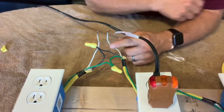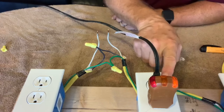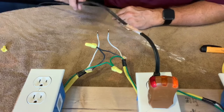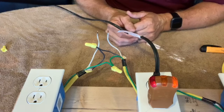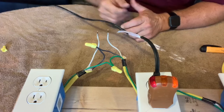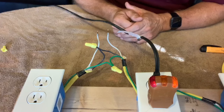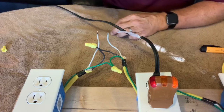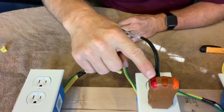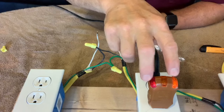It comes on because there's now a voltage difference between the ground wire and the neutral wire. That's because this neutral wire is now live — it's got 120 volts. That's because you've got power flowing through the hot leg of this cord to the lamp, through the bulb, back through the cord. When you don't have current flowing, there cannot be a voltage drop, so there's no voltage drop at the light bulb. Instead, it's basically just a conductor — it's conducting that 120 volts. You've got your voltage difference between the neutral and the ground, and between the hot and the ground, and that's what causes these two lights.